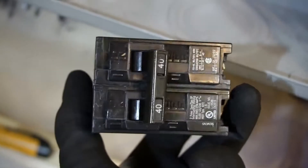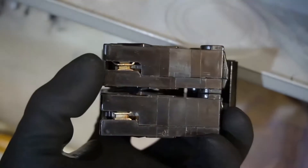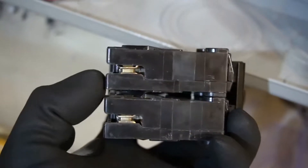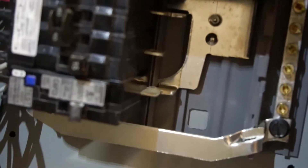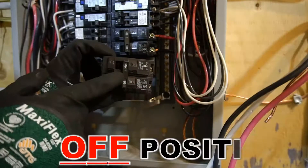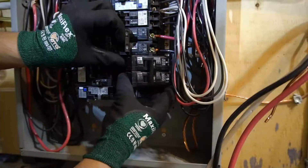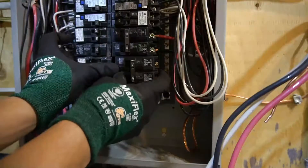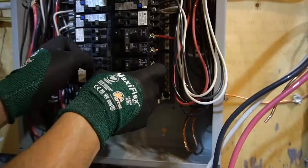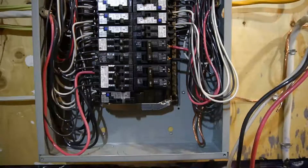Now let's take a look back at the breaker. If you turn it to the side or the bottom, you can see there are openings — there are slots. That's where the blades come into place: slot 1 and slot 2. That is where these blades go into. Always double check — make sure the breaker is in the off position. Now I am ready to slide the breaker all the way in the corner. Make sure it's nice and tight and close in the corner. Now I'm going to push it down and make sure the blades are slotted into the slots. Now it's in. And that's how you install your double pole breaker.